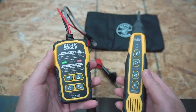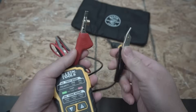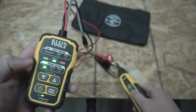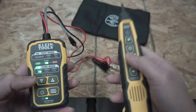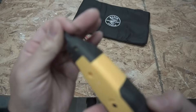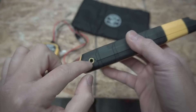The tool we'll be using is this cable tracer — it comes with the toner and the probe. I'll leave a link in the description below so it'll be easier to find. It comes with two alligator clips, red and black, and also a phone jack. We're going to focus on wires using the alligator clips. Turn both on and it's going to trace out where the cable is. The closer you get to the end of the wire, the louder the tone gets. Key features of the probe include a replaceable tip, a built-in light for dark areas, a speaker, and an earbud jack if you want to use headphones.